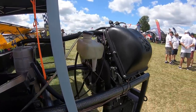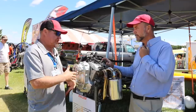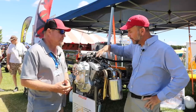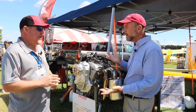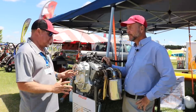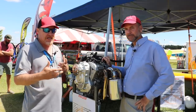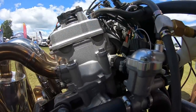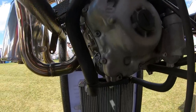There was a large group of people wanting a four-stroke 582 solution, so that's why I developed this gearbox. It ends up being about 15 pounds heavier than the 582 with all accessories, but you get a couple extra horsepower. This is a clean-sheet design — the housing is designed specifically around this engine case. I get asked a lot if my gearbox could work on a Mazda rotary or other engine. As much as I'd like to sell one, I have to tell them no — these gearboxes are so specifically designed for their application they're not a good universal solution.